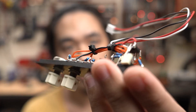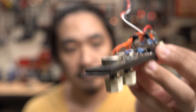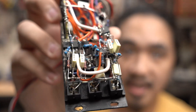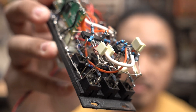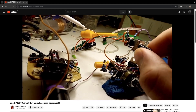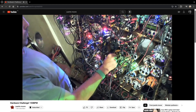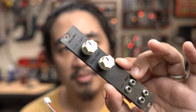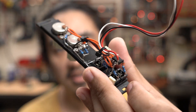In this video, I'd like to talk about dead bug builds. It's a way of building circuits without using perfboard, stripboards, or PCBs. With dead bug, you only use wires as well as the leads of the components to connect parts together. It's mainly been inspired by Juanito Moore's builds, where he makes really small balls of wires and components and jumps them into tin cans. I'd like to show you how I do it by using this mini mic build that I just made. It's based on the Ears module by Mutable Instruments, and I use it to amplify piezo transducers.